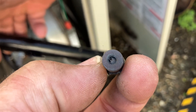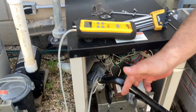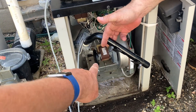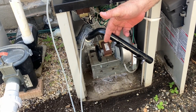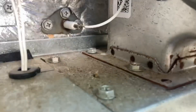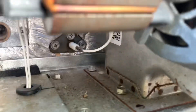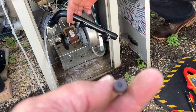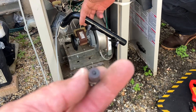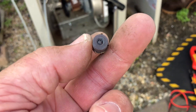We can see a little buildup of cobwebs in there. We already hooked up our manometer to the inlet side of the gas valve, took out the hot surface igniter and confirmed it's good, ohmed it out as well, and then took out the flame sensor — that's the part with three screws and one single white wire — and cleaned that. But at the end of the day, we don't get flame sensing because of the cobwebs.